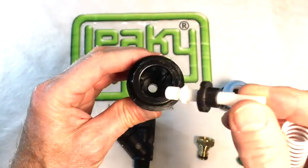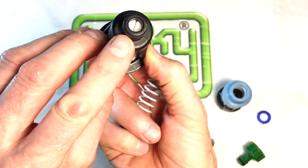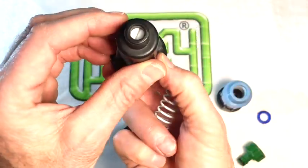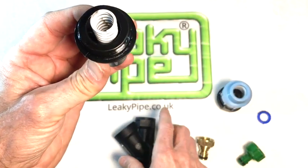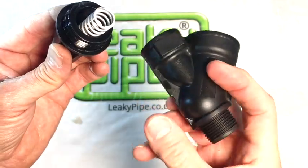When we put the stem back inside the extension, make sure that it's actually traveled down properly. There's the adjuster at the end, which you can use a flat screwdriver on — rotate clockwise to increase the downstream pressure or anticlockwise to decrease the downstream pressure.